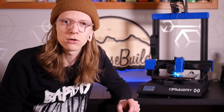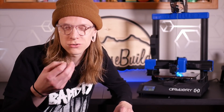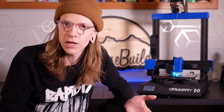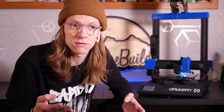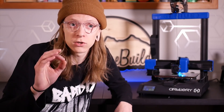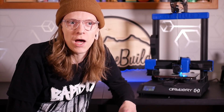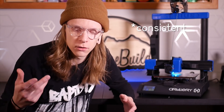It has a Titan extruder. I find they're super handy for putting your material in and using the gear to jog the filament through, so you're never pushing filament or putting strain on the hot end. This is the first machine I've used with the Volcano hot end — it's longer so your filament spends more time in the hot zone, meaning you can push more filament through quicker, increase print speeds, and maintain good layer adhesion and consistent temperatures.